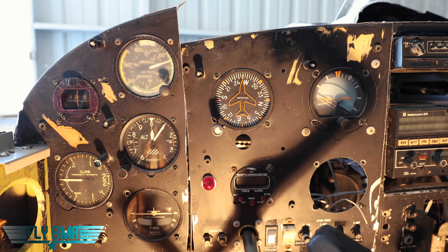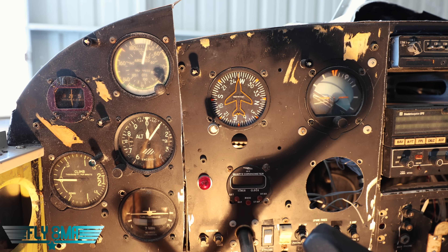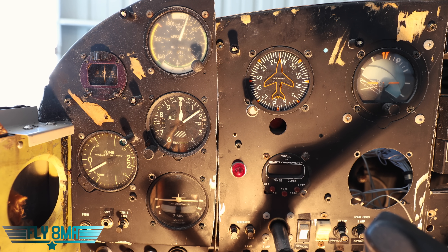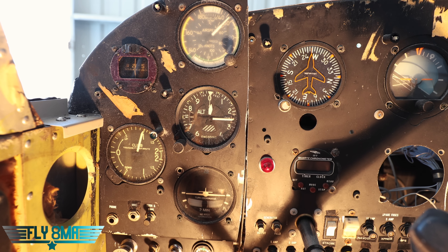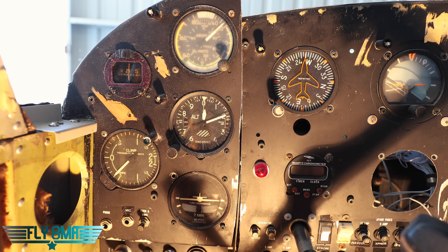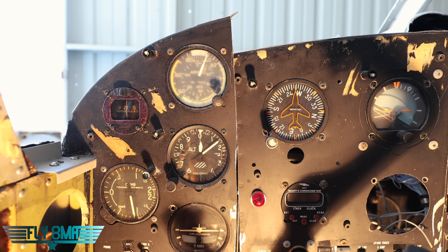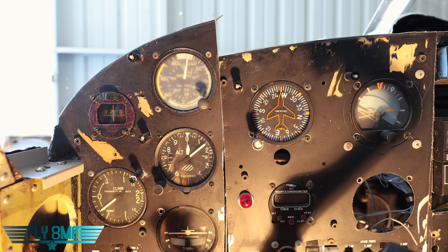So now what's going to happen if we go up in altitude? Well, we're going to drop our pressure — that's the same as sucking on the static port a little bit. We're about a hundred feet above sea level right now. Oh boy, that was 2,000 feet a minute! Going real gentle, sucking on that static port — a thousand feet a minute climb, and we're up at 250 feet. Also notice how your airspeed indicator is responding to that — she's not blowing on the pitot inlet at all, just sucking on the static port. You can see how that static port plays into the airspeed indicator.